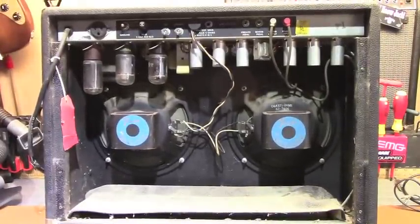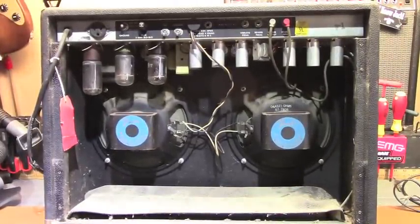The reason I said it was 1975 is because I did open it up earlier and the transformer dates are all '75. This is a lesson right here — you have to take into account the totality of all of these numbers when trying to assign a year of manufacture to an amplifier.